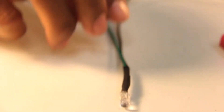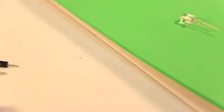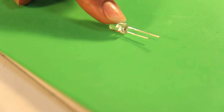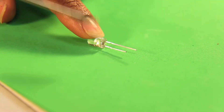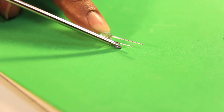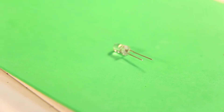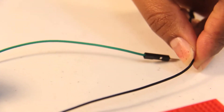Our goal here is to light up an LED. This is what the LEDs look like in your kit. An LED that you might buy elsewhere will look something like this. You will have a long end and a short end. The long end will be your power, and the short end will be your negative or your ground. LEDs flow like a one-way street, meaning current only flows in one direction. Your black wire will be equivalent to the short end, and your green wire will be equivalent to the long end.